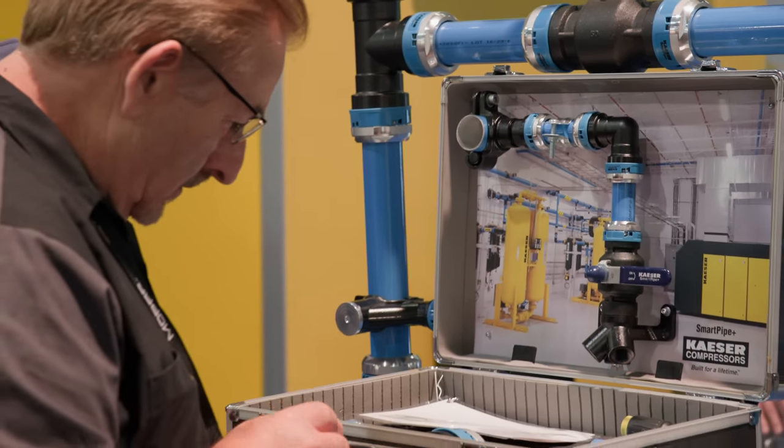One of the things I was looking at — boring for most people but fascinating to me — is the coupler system and airline systems they're coming out with now. Back when I first hung my shingle in 1985, we ran PVC until the fire marshal said you can't run PVC because it explodes and sends plastic flying. Then we went into a green pipe — overpriced — then black pipe. This stuff you literally just unscrew, put another piece in, screw it back in. The stuff that we have right now is nowhere near the quality of what it has evolved into in today's world.